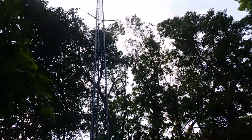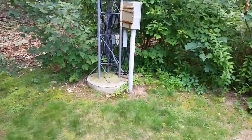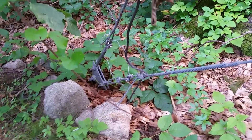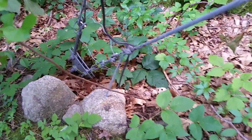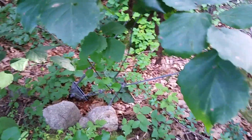My goal now is to make sure the tower stays upright, that it's safe for my neighbors and myself. I do that by regularly checking the base, the guy wires, and the anchors. I have a yard and a half to two yards of concrete buried four feet down. At least once every couple of years, or whenever I'm going to climb, I remove all the leaves and check that the one-inch anchor bar is not losing its galvanizing and is still perfectly solid. That's one of the things that kills people — they don't check the guy wires.